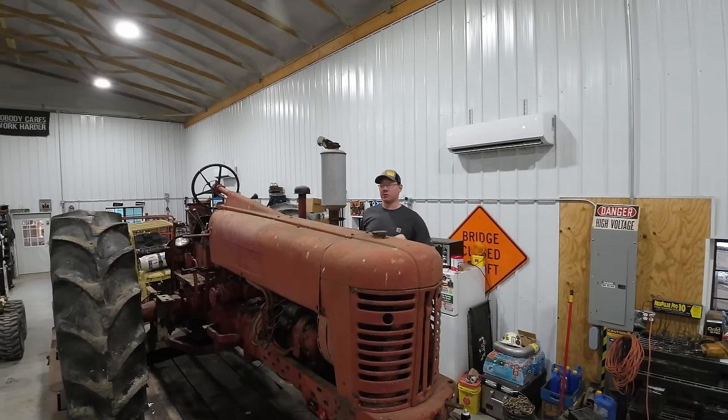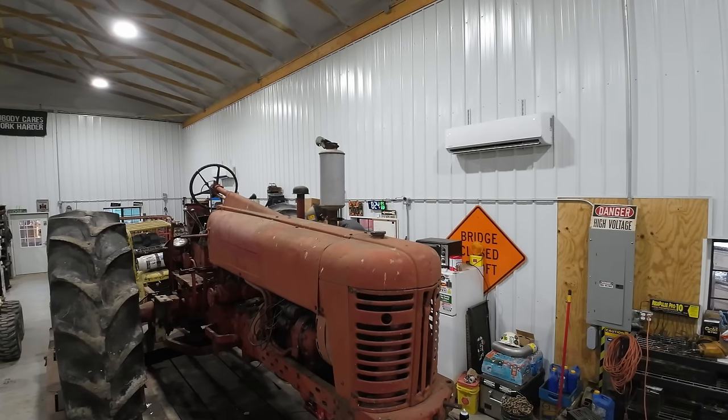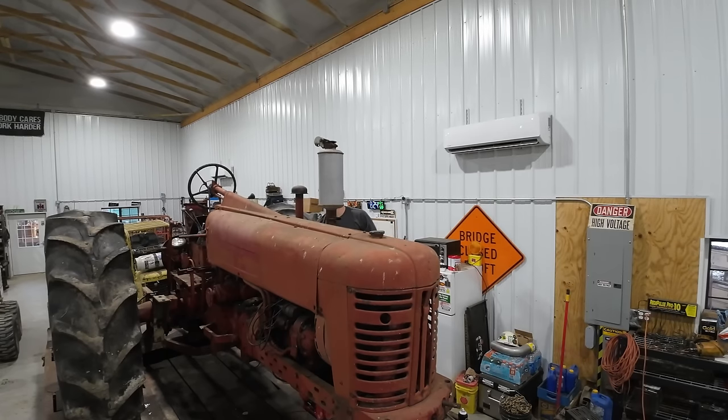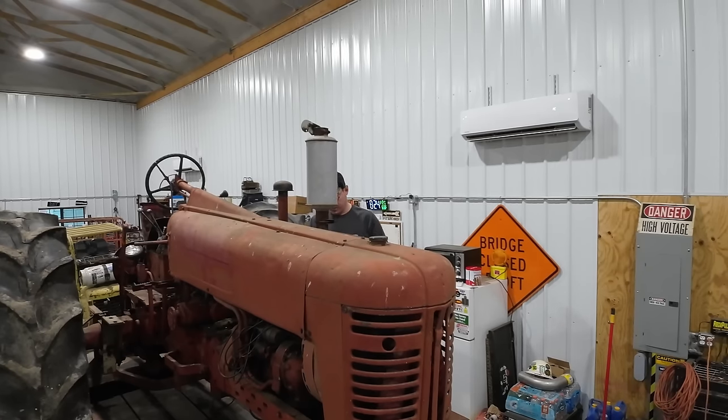So we did not have spark, so I went through and I cleaned the points a little bit more aggressively, and I'm 99% sure we have spark now. Let's go ahead and give this another go. The choke is on, no ether. Still nothing. We're gonna give her a little snort and see what that does for us.